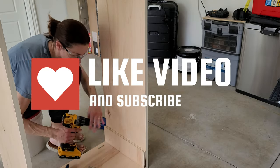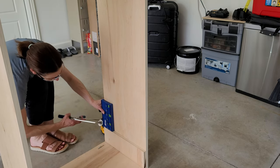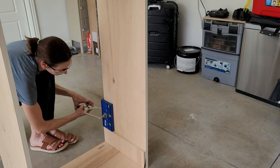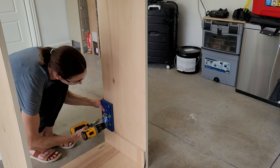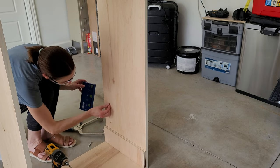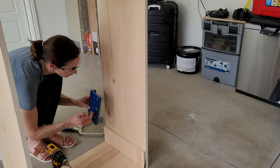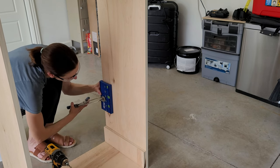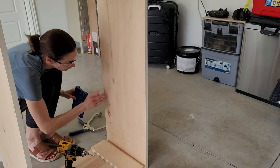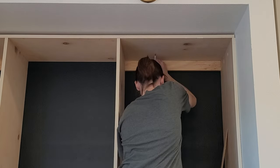For my outside cabinets I'm going to have adjustable shelves, and I'm using this Kreg jig for pin holes. I like to put a spacer board along the bottom of each one because I'm never going to put a shelf that low. I use my clamp and then the drill bit that comes with the jig, doing every other hole because I don't need that many options. I put little pieces of tape to remind me which holes I'm drilling — that goes at the top, I make sure it's flush, clamp it, and drill. I did this six times for all the shelves. When all your pin holes are done you can do a light sanding to make sure any little bits are gone.